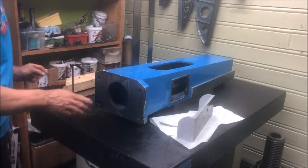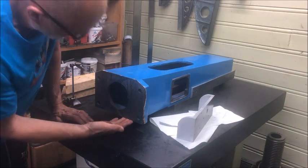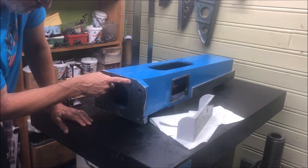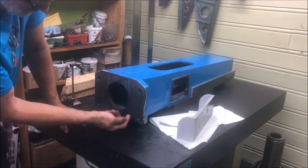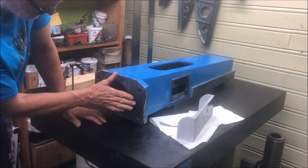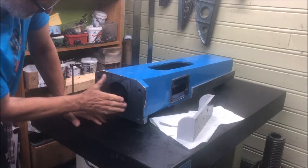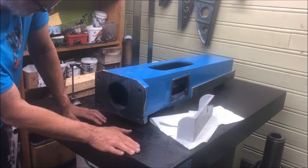The main thing is that the lower or front portion is flat and then starts to drop. That's why I measured this being zero and this being six hundredths of a millimeter low. It's not entirely gradual — it's more like flat and then steep down. This makes for a sort of pivot point, so it's no wonder that this is not stable. Less surface area means it is less stable, and the more error-prone your setup or performance will be.